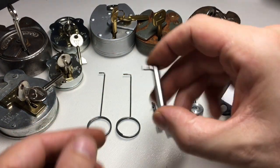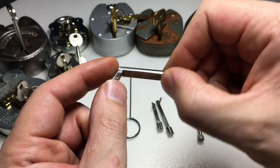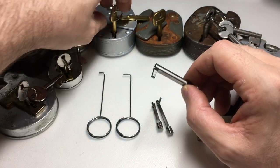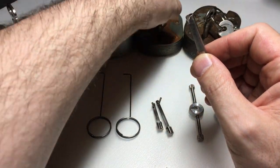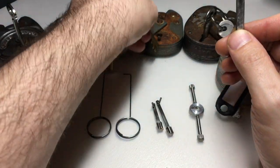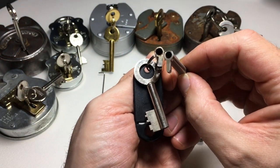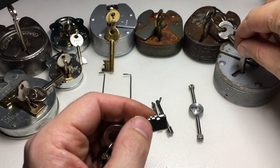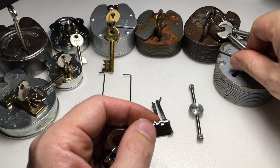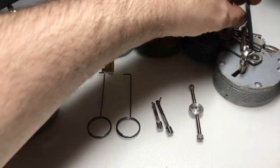You also get a bigger tension tip which is a lot thicker — it's welded stainless steel and it's tubular — because a lot of these other locks have an upstand within the lock to guide the key and they're all tubular. Even the Chub Cruiser is the same. Worth mentioning: even though the Chub Cruiser key is an offset shape, this does actually fit into that keyway and it does apply tension to the bolt — so you're golden if you've got the skills to pick it, which I don't, at the moment. I'm working on it.